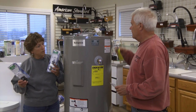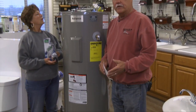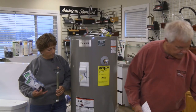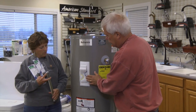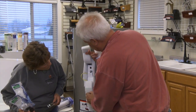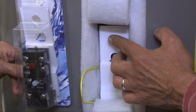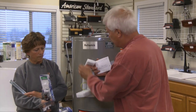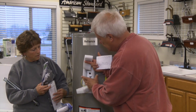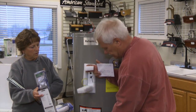Speaking of the elements, there's an upper and a lower element, and also an upper and a lower thermostat. We'll take the cover off the upper one — everything is well insulated here. There's wires because this is an electric water heater. On the upper thermostat, there's a reset button. So the first thing to know is if you don't have any hot water, just take the cover off and press the reset button. Give it a while, and maybe that will take care of it.